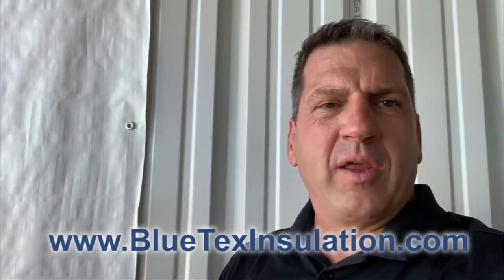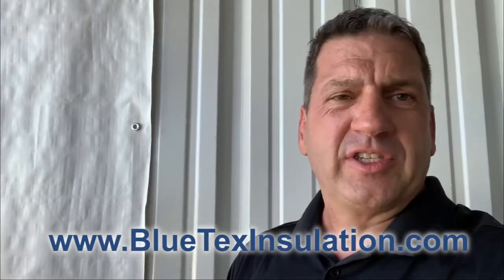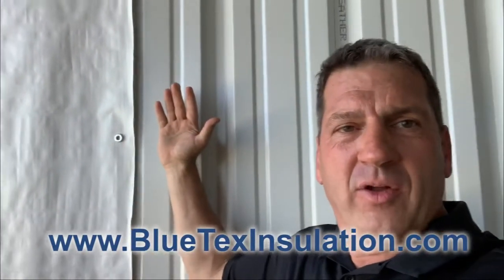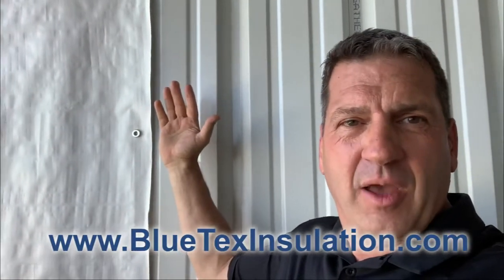How do you know if you need a radiant barrier inside your metal building? It's really simple. All you got to do is feel. You put your hand about a half inch away from that metal. If you feel heat coming off the metal, you need a radiant barrier.